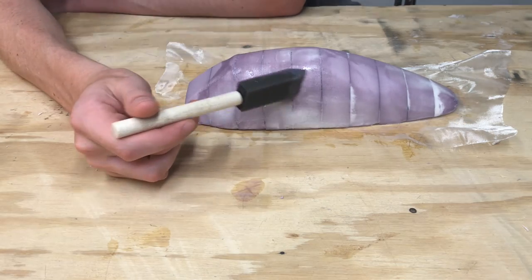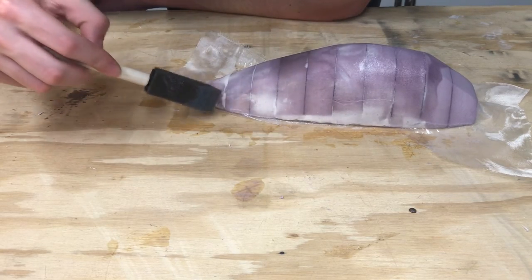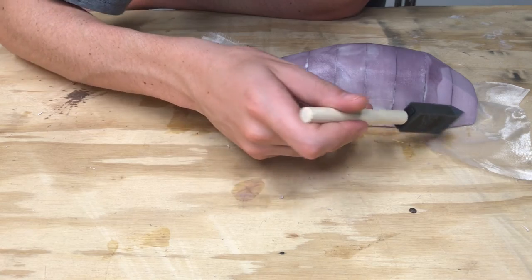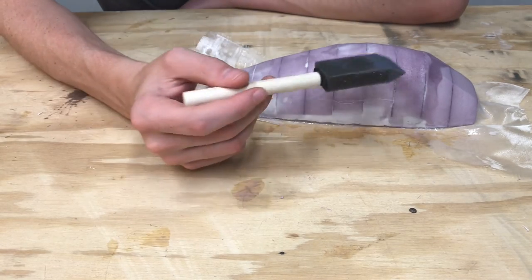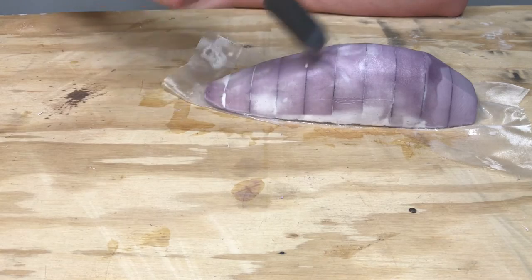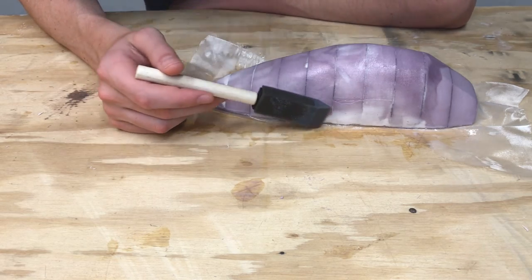Flipping it over so you guys can see it here — very careful because it has not dried yet. On the side I did exactly the same thing. If you see a part that needs finishing that you didn't go over, just get a little bit more polyacrylic and dab it on there. Or if you've got a lot of polyacrylic in one place, you can brush the excess back and use it to fill that. The finish on this is very matte — it looks basically like it did before I put the fiberglass on it. There's not a lot of shine, not a lot of gloss, and that is a very good thing. You do not want a lot of polyacrylic on this simply because the fiberglass fills very well with only a little bit, and ultimately that's how you're going to get the maximum amount of strength and durability out of this.